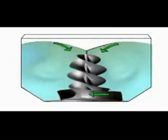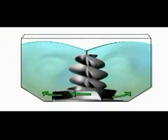the rotor starts slushing material into the thick pulp of 12-15% consistency. Fibers are completely disintegrated without cutting action on the contaminants within 15-20 minutes, depending upon the quality of raw material.